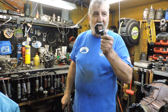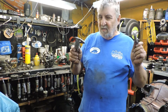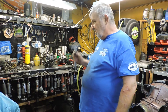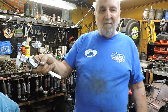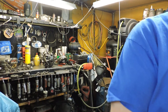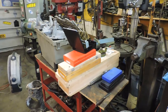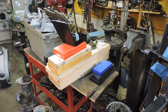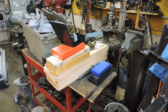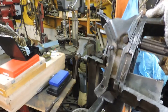This is nice for setting up pinion shims and ring gear shims — the whole nine yards. I use both of these constantly; they're just handy tools to have. Over here's a depth mic for measuring deck height on the motors. I've got a jig, a brand new line boring bar, two — actually three — deck height gauges, a bore gauge, and a mic for setting up the knives. You never have enough of them.